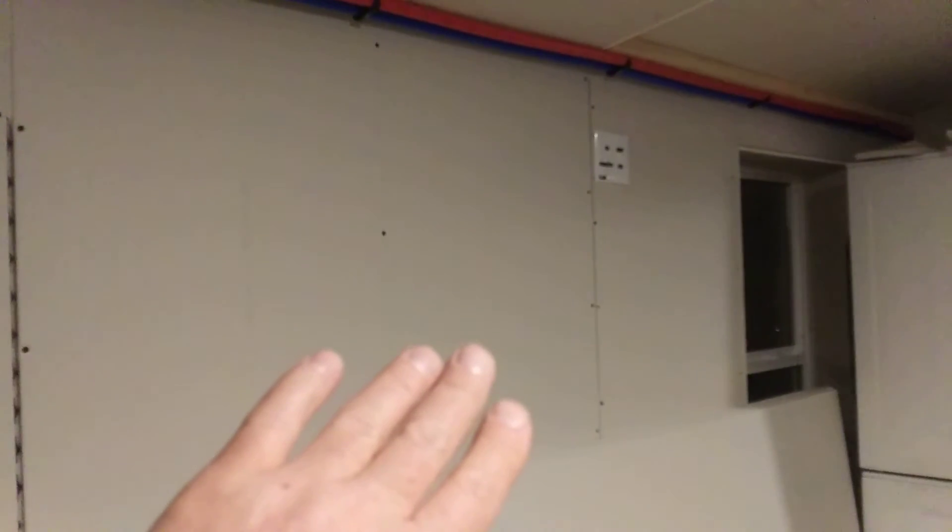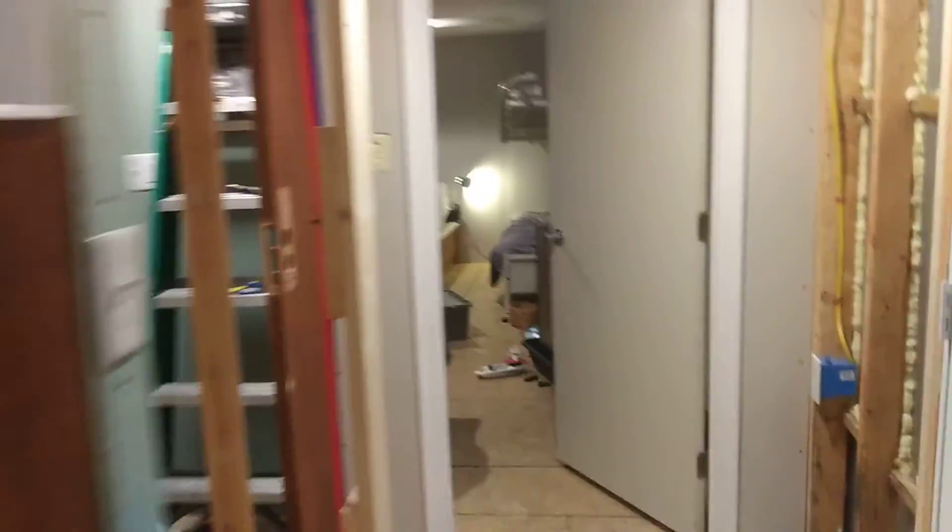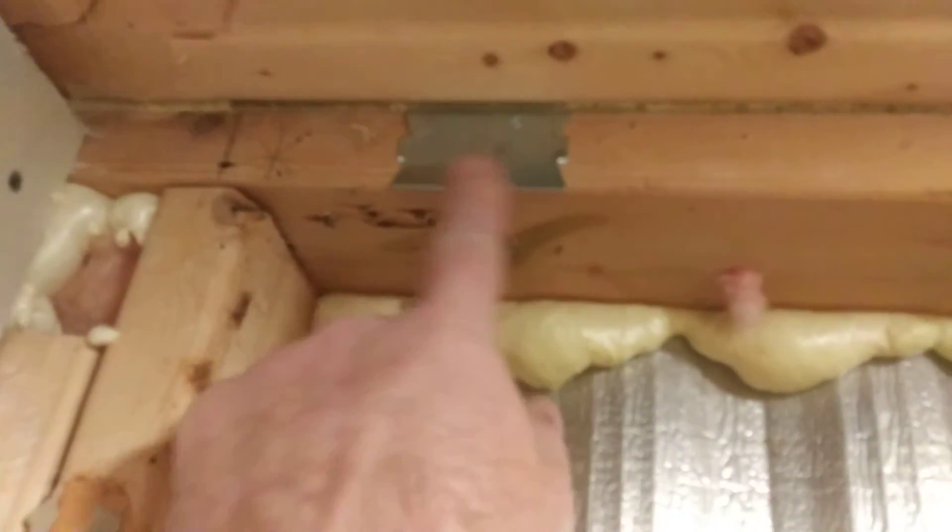So before I put this drywall up, I went out and got a big sheet of metal — a 24-gauge piece of flat roofing stock. We have a Lions Metal Roofing here in town where you can get 24 or 29-gauge flat stock before they run it through the dies. I went down and got a good-sized piece of metal and screwed it across the studs where my four-inch pipes were, then put my drywall up. You'd have to work really hard to get through 29-gauge metal with a screw or nail. Protection plates — super important. Run them everywhere there's a wire.